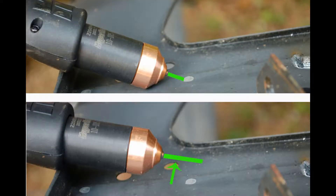This two-part photo shows the 45-degree angle of the torch position for gouging spot welds. It also shows the up and down movement for the feathering technique. We'll also use a triggering technique — starting and stopping the arc.